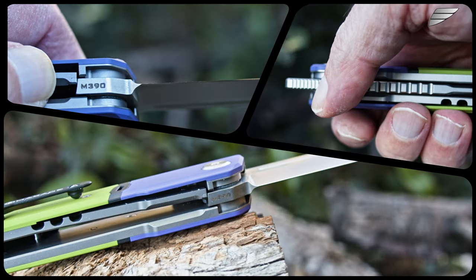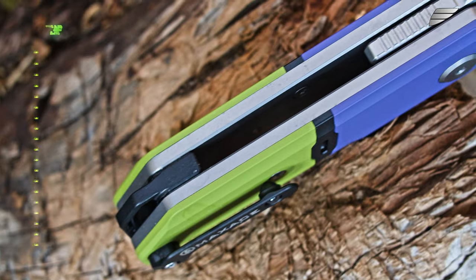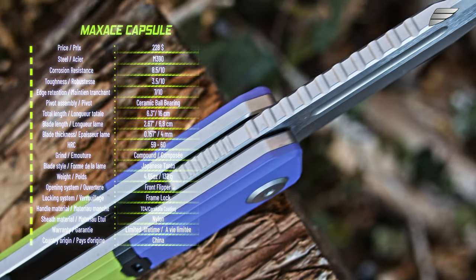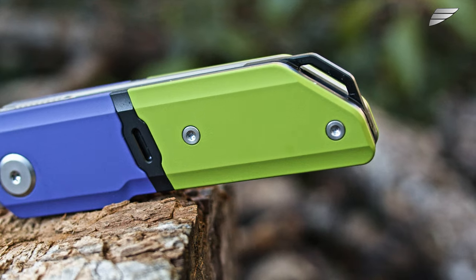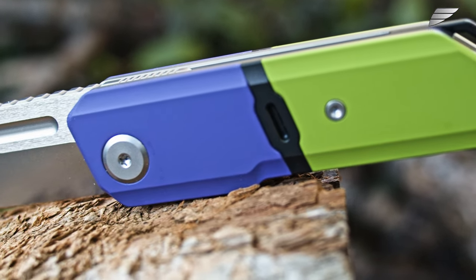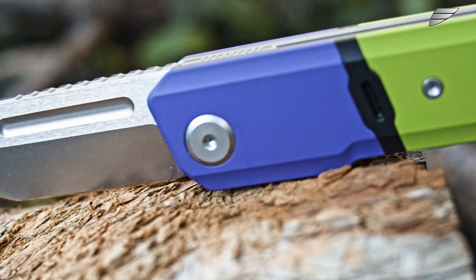Cerakote is a material manufactured by the American company NIC Industries. Cerakote is a ceramic-based material offering high resistance to abrasion, corrosion, and chemicals. Cerakote also withstands high temperatures and is unaffected by UV rays. Its coefficient of friction rivals that of Teflon. In other words, it's a coating that favors glide.